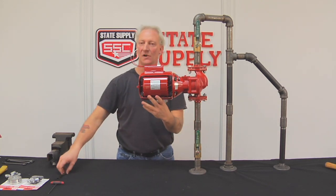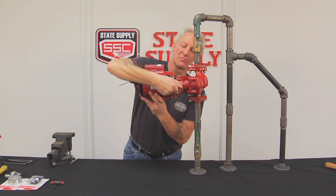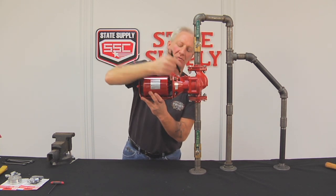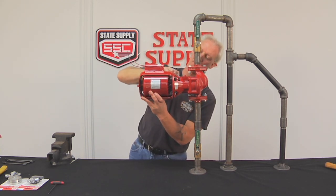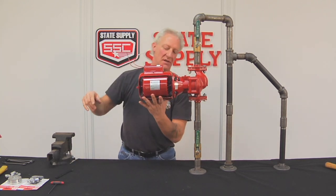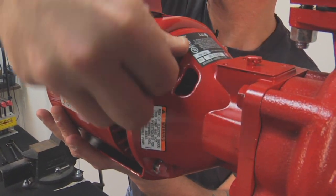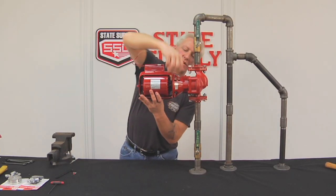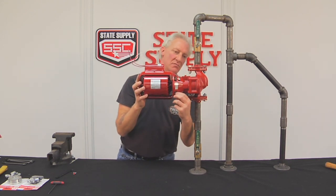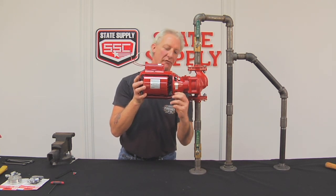Let's tear it apart. We'll loosen the four motor bolts here and we'll separate it from the bearing assembly. Then we'll take them out by hand and support the bottom of the motor and unscrew them. I like to leave one of the top ones in because if your hand slips off, the motor won't fall off.